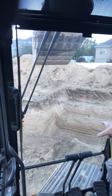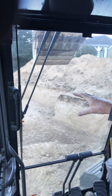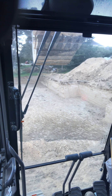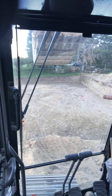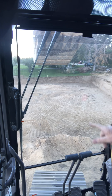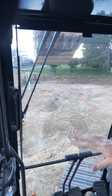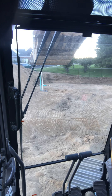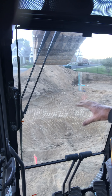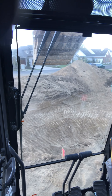That corner right there is kind of where the house starts. This will have 10-foot basement walls — we're going to cover them all up, do a foundation wall over there. Sewer and water is in and done. The homeowners didn't know where they wanted the elevation, so I cut it all down within about 6 inches of grade. We've got another garage that's also going to be suspended with a room underneath it.